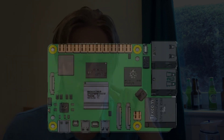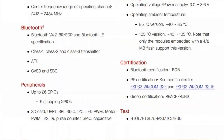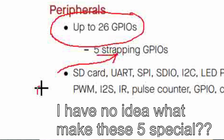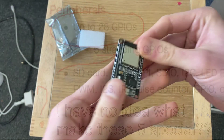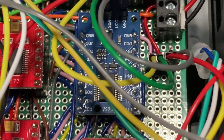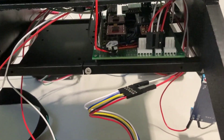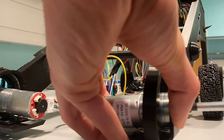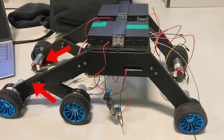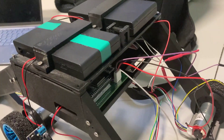The drawbacks of the ESP32 are its GPIO pins — or more accurately, the lack of them. Each of my motors needs six motor connections, and doing the math, we've run out of pins pretty quickly. We'll use an extender board to get more and make an assumption about our system: for controlling the motors, we'll just connect the powers and grounds of all six, and only the encoders of the first two, each on an opposite side. This will provide the feedback to our theoretical control system.